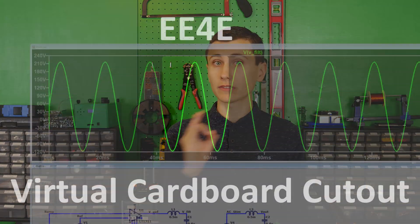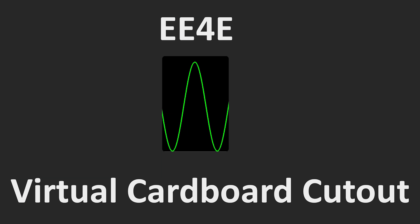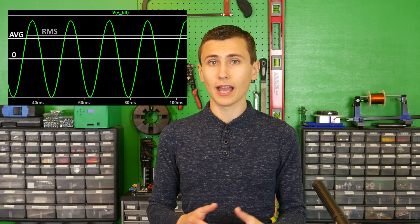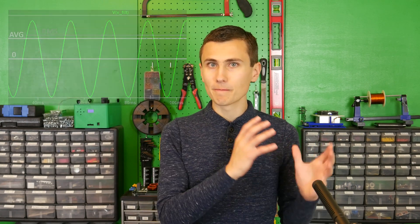Instead of doing all that, we just grab data over the course of 25 milliseconds. We know that over those 25 milliseconds, we will always have exactly three half cycles, and those half cycles will be aligned somewhere within the window — but there will always be three full and complete half cycles within it. We can then use math to compute the average or RMS voltage of these three half cycles to closely approximate the amplitude. Based on what I'm seeing so far, regulating to average voltage is a very close approximation to regulating RMS or true amplitude.